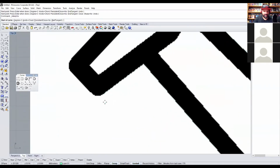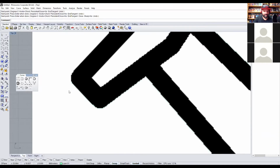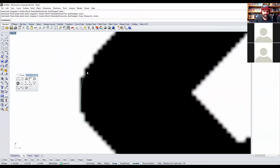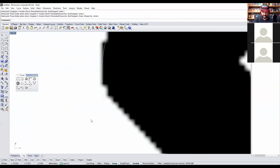Okay, and this is the drawing I'm going to send to you for practicing, so that way you can follow along with the video. And make sure that you are snapping and not just left clicking and starting, because then it's not joined together. That's the number one mistake you're going to make. If I zoom in here, I'm sure you see it, it's not connected. This is the major problem that most beginners have, not having them joined, connected correctly.